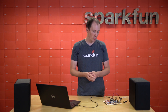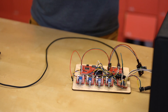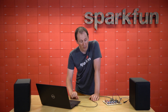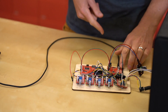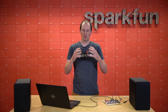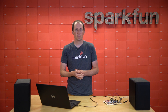Next, let's jump into some Qwiic control. I'm going to program my Redboard Qwiic and it's going to control the Tsunami over the Qwiic cable. For this first Arduino library example, it's really basic — it's just going to play a WAV file using a Qwiic command. All the examples first run a standard begin function that checks to see that the board is present on the bus. If I hit reset on the Redboard, I get track one playing. And if something's not connected, I get a nice serial debug message saying the wiring's not right — try reconnecting.